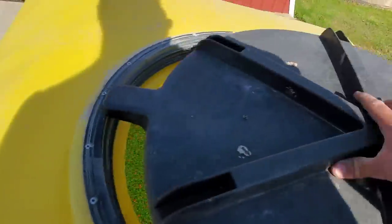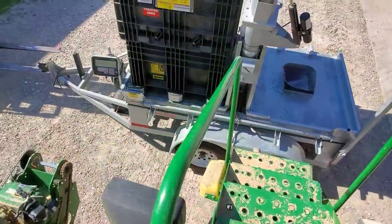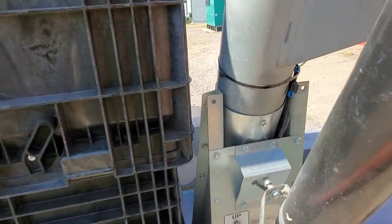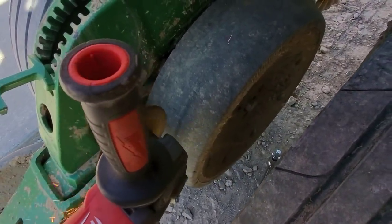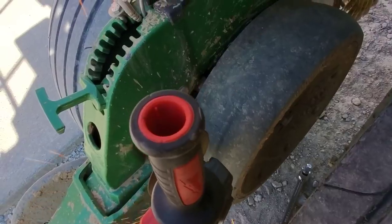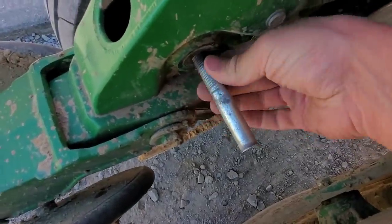This one's a pretty small seed size, but we've got 40 more units — 20-ish in each side. This is a 100-day corn, OOH12 is the number. You guys remember that gauge wheel I said I couldn't get to adjust in the field? Well, I still can't — even with the big wrenches. So I'm cutting the thing off. Let's find a new bolt.